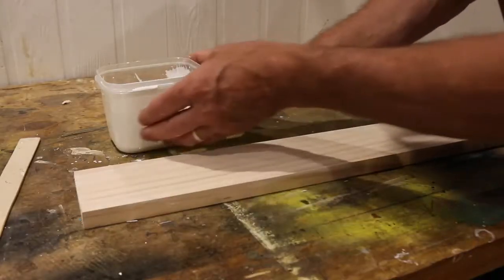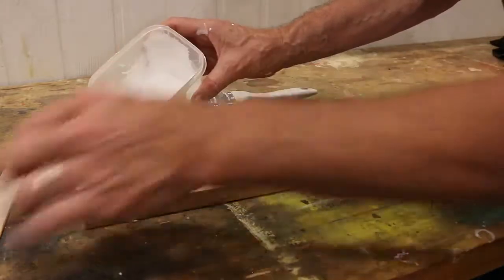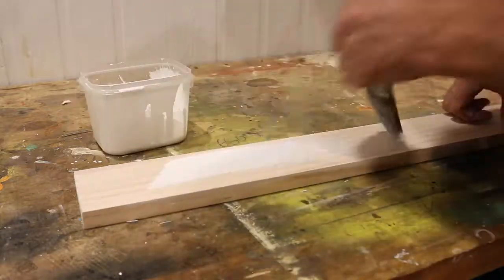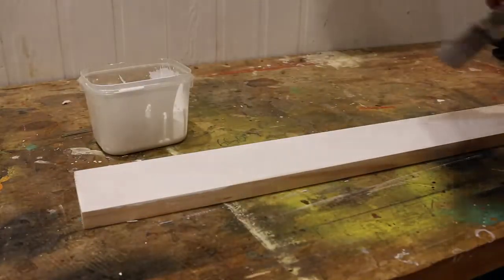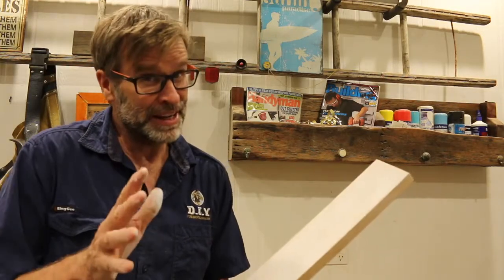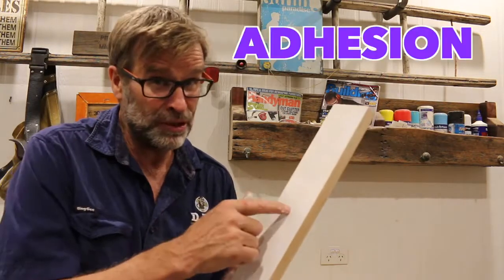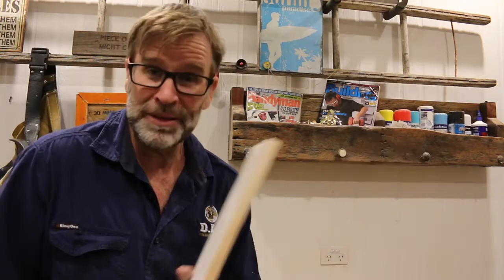Now, one of the most common ways that most people use to whitewash furniture is to get some water-based paint and add some water to it, which thins it right out. You give it a bit of a mix and then simply with a paintbrush or a rag, just apply it to the piece that you're working on and that'll give you that nice, washed out, aged appearance. But I do have a few issues with watering down your paint, in that whenever you get a good quality paint and water it down, it starts to affect the quality of that paint, especially in regards to how well the paint will stick to your furniture, the durability of the product, and also the colour consistency if you're mixing up different batches of the same colour.